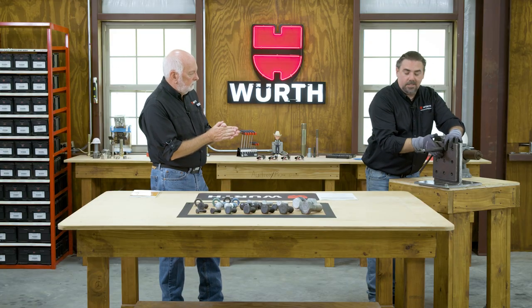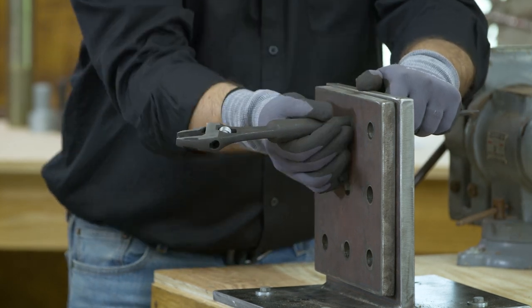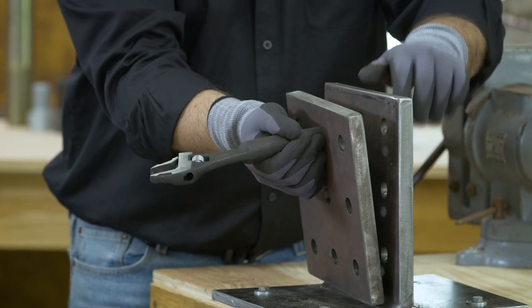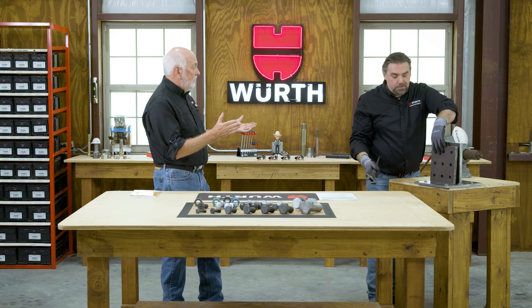The complex load is that it's wanting to go down and also wanting to separate where these two pieces come apart. And then last is going to be tension only, where it's just trying to separate because of the forces acting on it. So three different force directions that we need to know what we're dealing with.